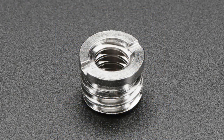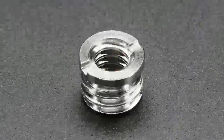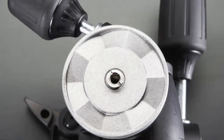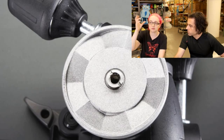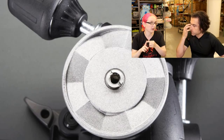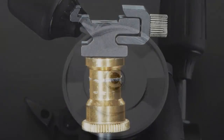We now have a bunch of photo and video adapters, suggested by Pedro who does many projects involving photo and video. First is a 3/8-inch to 1/4-inch screw adapter — it lets you take something that normally takes a 3/8-inch screw and have it accept a 1/4-inch screw. Great for tripods and photo adapters. What they really use it for is 3D printing: you 3D print a camera light or accessory, screw this in since it has big threads that grip into the print, and then you have a strong 1/4-inch mount without needing a proper threaded insert.